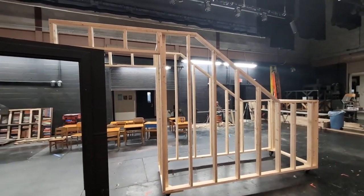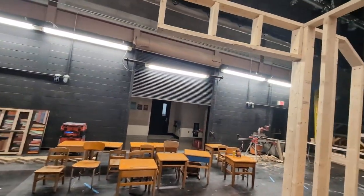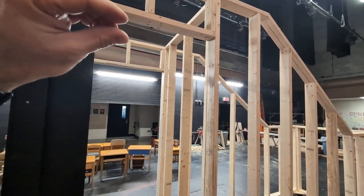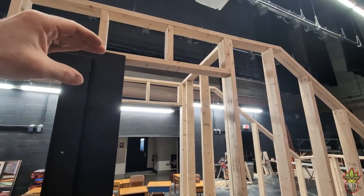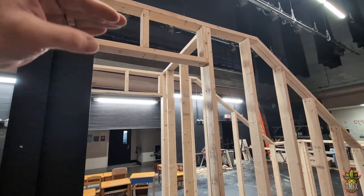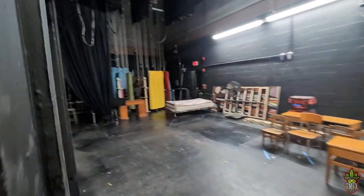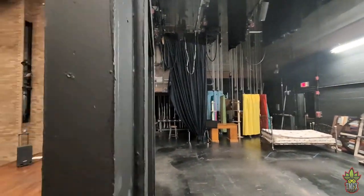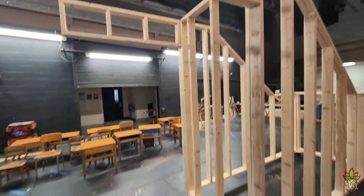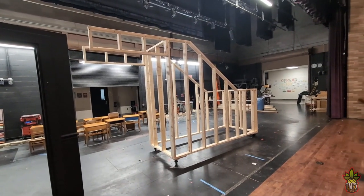But if you're going to roll them together and apart and change things around, which we haven't decided which way we're going to go, then you have to have more height. Even with that Luan surface, you really want an actual quarter inch difference in the overall height of this. And so I would have to take half an inch out of all these short sticks and set this all back together again so that when I add a quarter inch Luan, I still have a quarter inch of clearance. I had been thinking we'd attach this permanently, and that's how I'd like to start. And if I get all that done and they say, well, can we make it separate? Then we really got a project.